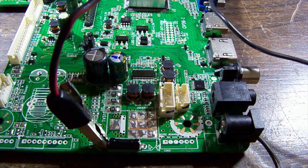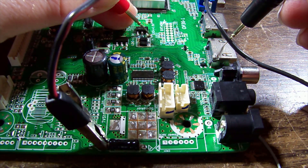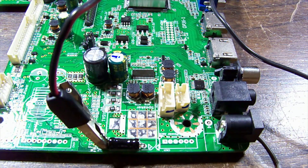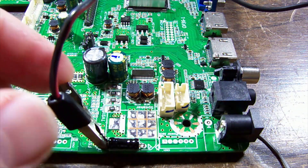It's currently in an off state - when you put power on it comes into an on state temporarily. Checking now: we've got 3.6 volts on that regulator and 5 volts on that one. Then it goes into standby after a couple of seconds. I'm happy that's working.